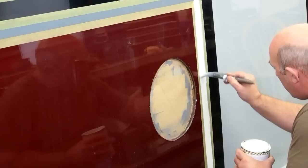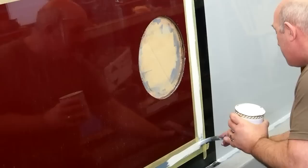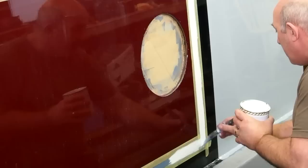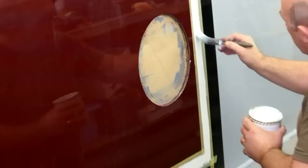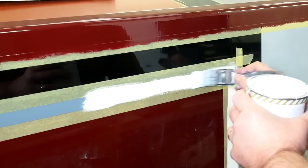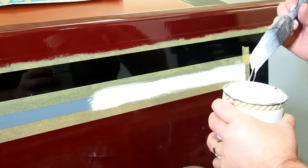I've got an inch to paint and an inch of tape either side, so my brush fits quite comfortably on the coach line with no worries about overlapping the tapes. Good quality tape will give me a nice sharp line when I pull the tapes out. One reason against painting horizontally: if you get too much paint on, you've got a chance of getting a bit of a sag, because you're asking the paint to hold up horizontally. Also watch for lapping if you don't brush the paint out. Generally speaking though, they're not too much to worry about.